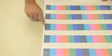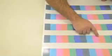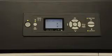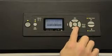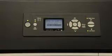The GS6000 will automatically print a print sample chart. There will be 5 different values for this chart. What we are looking for in this chart is the cleanest pattern for the microweave. Once we pick the cleanest pattern, the GS6000 will now wait for us to enter the value that we feel is the correct one.